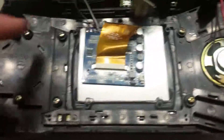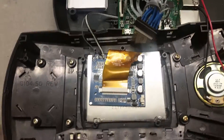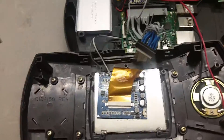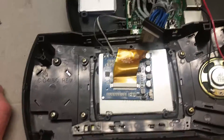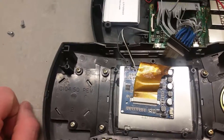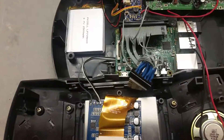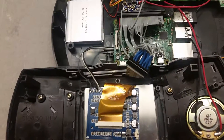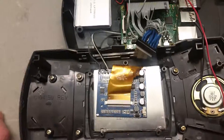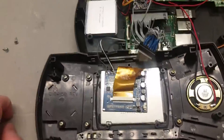You can see the original flat panel connector — which is actually the flex circuit that has all the buttons. One thing to note is that if you're inserting and removing that a lot, those are graphite-coated traces that eventually rub off. The way to fix it is you can cut a millimeter off the end of it every time you run low on traces. This connector is getting pretty small, so I'll have to either repair the traces using silver conductive pen, or just replace the flex circuit. Best Electronics has flex circuits for about $10, so not a big deal.